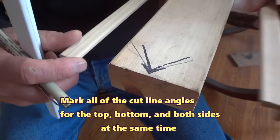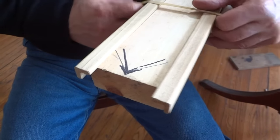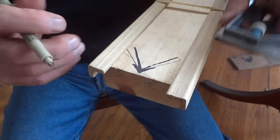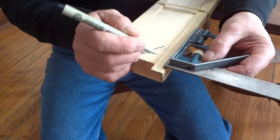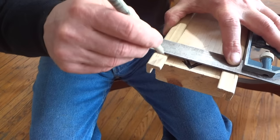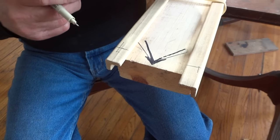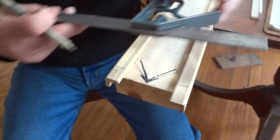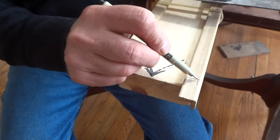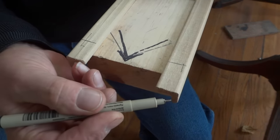I'm going to take two of these eight-foot lengths, put them alongside the two-by-four, put a rubber band down here to hold it in place. Now I've got to make some marks on here so I know where I'm going to be doing my cut lines — about an inch from the end. I'll make a mark here and a mark here, then one more mark that's going to allow for my actual cut line, drawing my 45-degree cut through to account for that little offset.